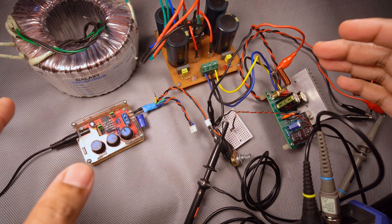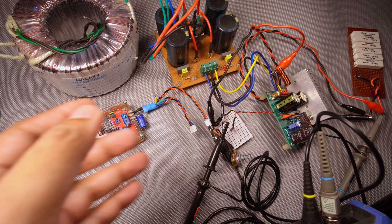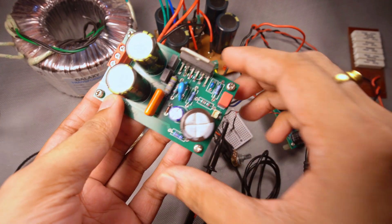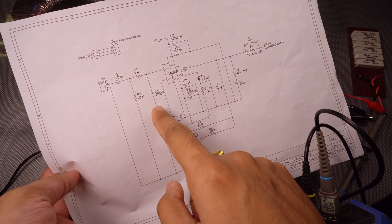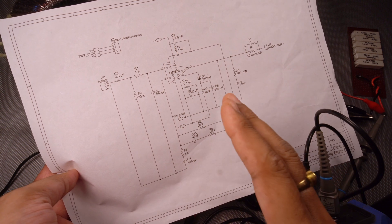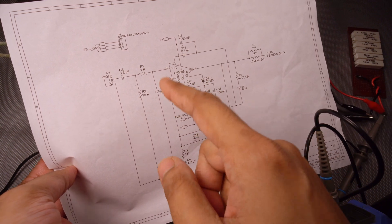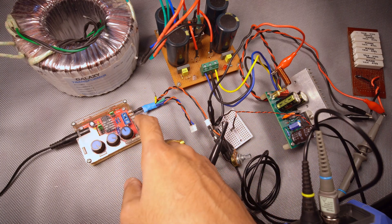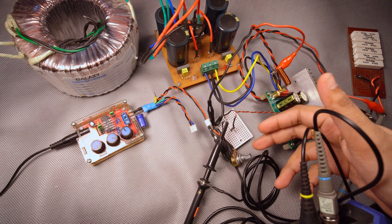I have made the setup for the stability test and there are some pre-requisites that we need to do. First, we cannot have this capacitor here — this is the low pass filter input capacitor. If you see the circuit, it's basically this capacitor here. This is part of the low pass filter which filters out very high frequency noises or interferences. We cannot have this because if you look at a square wave, the rising and the falling edge are very fast and if you have this capacitor, it will just flatten that out. Next, with this function generator, we cannot control the amplitude of the square wave, so we will have one potentiometer here so that we can control the amplitude of it.